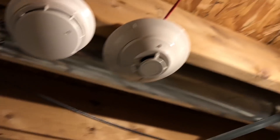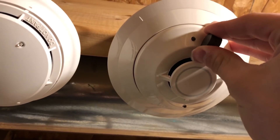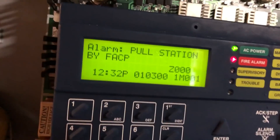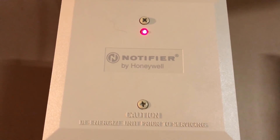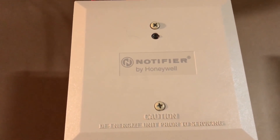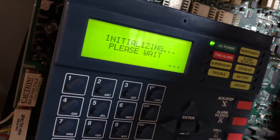I've noticed the heat detector accidentally has verification on, and that's my fault. Let's go ahead and set that off. There it goes — no verification. Now I've got to give it a reset before we can do the zone again because it's a zone. So you'll see that will shut off in just a second. We'll actually smoke it out because I haven't done that yet, so we'll wait for it to come on and then we'll give it a go.